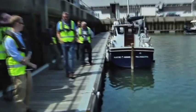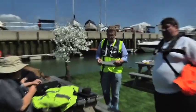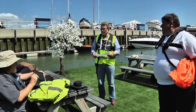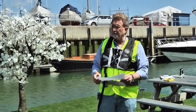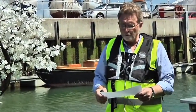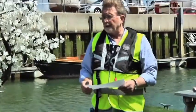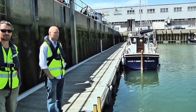There are three different types of vessel, essentially, that you might be doing a heel test on. You could be doing a heel test on a boat that has a continuous straight through deck that doesn't have a recess or a cockpit or anything in it. You could be doing a watertight weather deck, that is. You could be doing one on a boat that has a watertight weather deck, but it does have a recess such as a cockpit or a lower aft working deck that is above the freeboard required height. Or you could be doing one on an open boat. This thing we're looking at now is really an open boat, but we're going to probably take the measurements as if it was all the different options just to explain them.